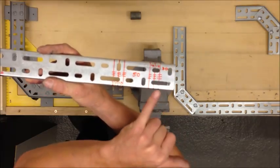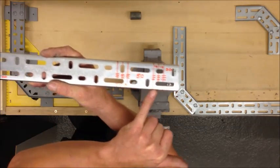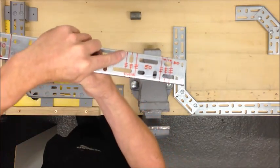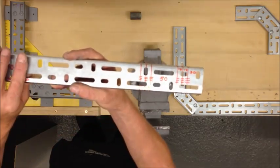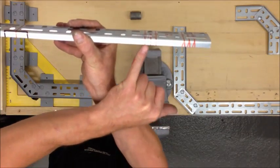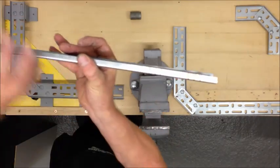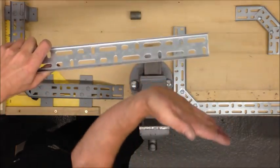To achieve this we're going to set out 30mm, 10mm and 10mm, by 50mm and 10mm and 10mm. These back marks with the strikes down are telling me they're bends, not cuts. They're simply to ensure that our lines and our V cuts marry up on the other side, so they will bend down straight — otherwise it will bend down at an angle one way or the other.